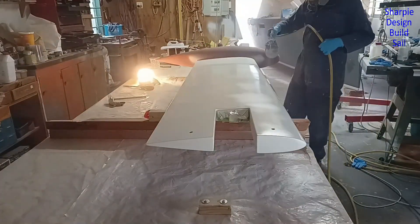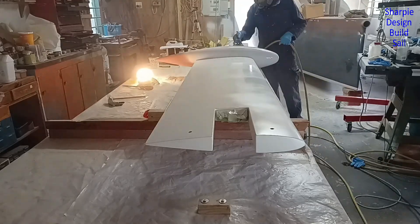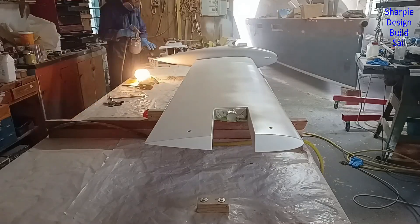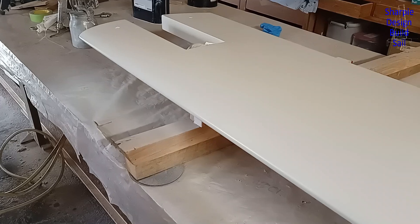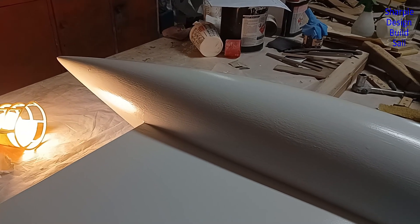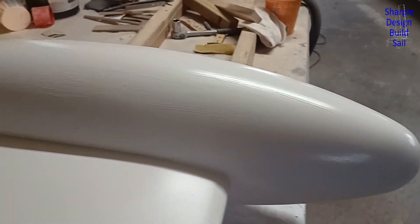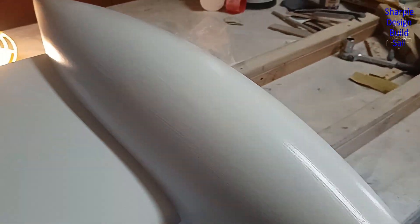As you can see the spraying didn't go very well. I think it was partly because the breather on the can was partly blocked, and also it's a very thick paint with a lot of solids in it. I had the maximum reducer you can use but I wasn't getting it right this time. It kind of went okay but I didn't mix enough paint. Why did I stop spraying and start brushing? Pinholes. Spraying on paint doesn't fill the pinholes, and pinholes are inevitable — I learned that with the hull but I'd forgotten that lesson.